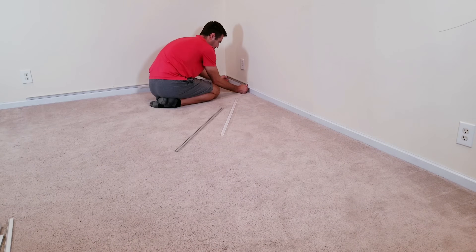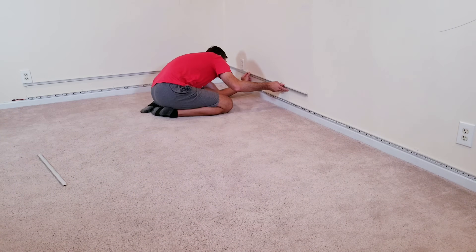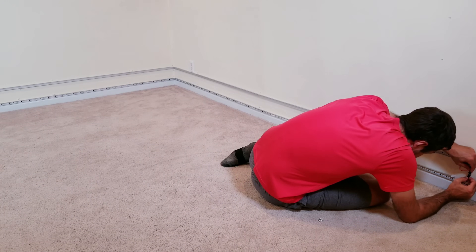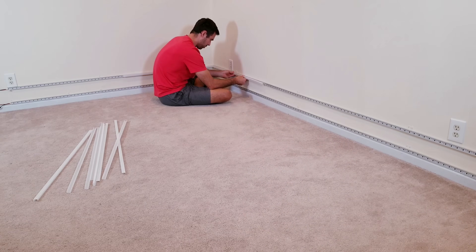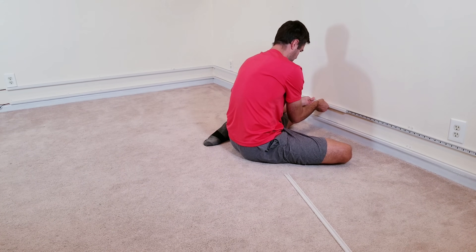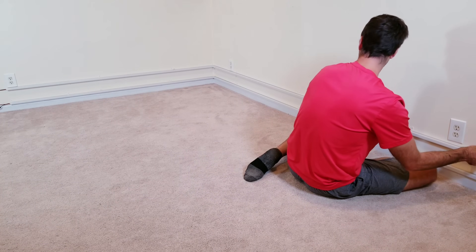The back side of the strip has normal sticky tape like you'd expect, and in my brief time using these everything is still holding strong. I already have my first 5 meter strip on the bottom channel and now I'll connect the beginning of my second strip to the end of the first. Then I'll snap the plastic diffuser covers in place. For testing I'll be using the same 12 volt 3 amp supply connected to the beginning of the bottom strip. I'll first demo some of my favorite animations running the WLED setup, then connect the default controller and demo those animations as well.